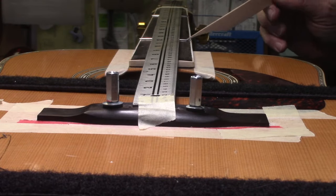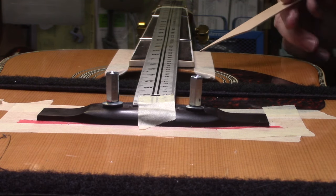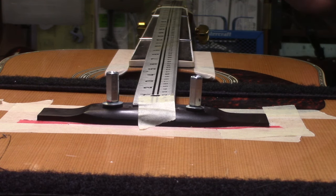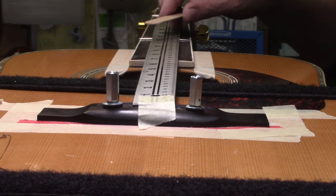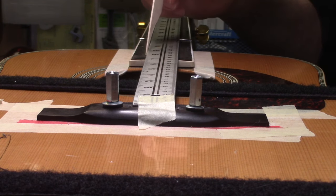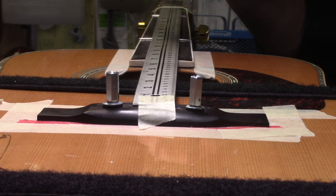As you can see, I've got my pilot frets in there, and we're going to check that measurement later. But I just wanted to give you an overall tutorial on how I use a GPS tech deck to hone in on the perfect neck angle. Because as everyone knows who's done this type of work, the neck has to be right this way and this way, and that is what we're lining up here. I'll bring you in for a closer look in a second.